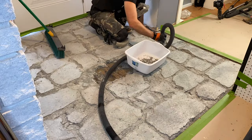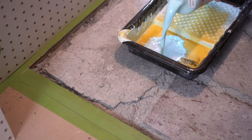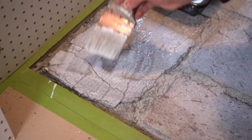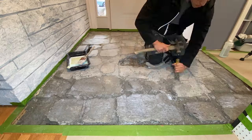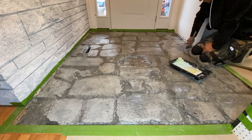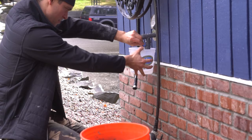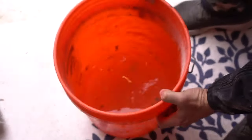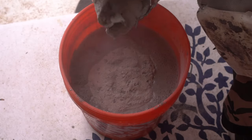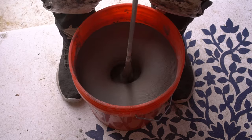Make sure you vacuum up the entire space to get all those small particles. Now, as you can see, this is a very uneven surface. The easiest way to get a perfectly smooth surface is to apply a concrete leveler, but first we want to prime the entire surface for proper adhesion between the mortar bed and the leveler. Whenever you're mixing concrete or mortar, I always suggest adding your water first, then your mixture — it's easier on your drill and ensures a consistent mix without dry spots at the bottom of the bucket.